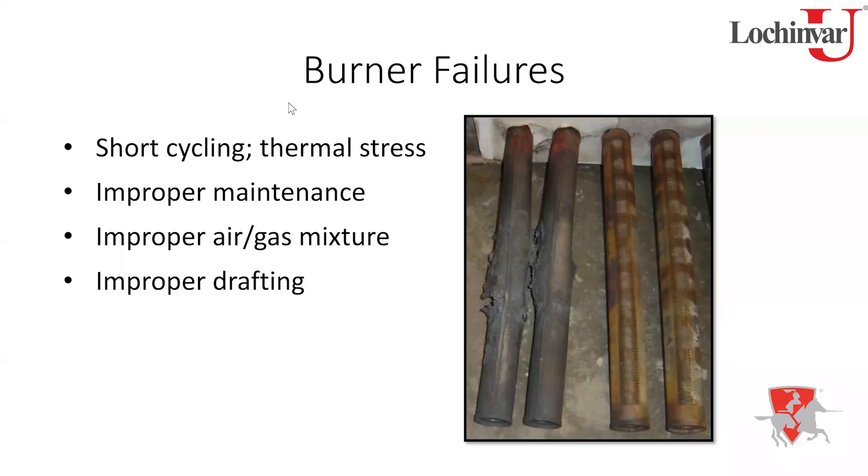The other main cause of burner damage is overheating, primarily from dirt. The burner is essentially the ultimate filter — as the fan runs, dust, dirt, and lint accumulate in the burner ports. As ports plug up, the flame pulls back into the burner surface, overheating it and causing damage. Ideally the flame should never contact the stainless surface — it should always lift off the surface.